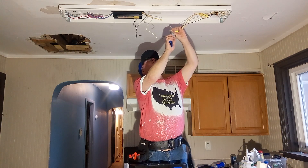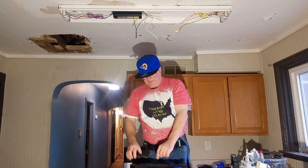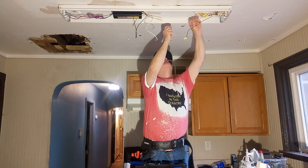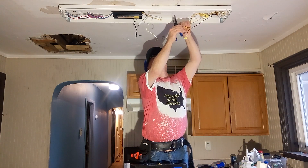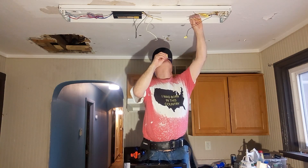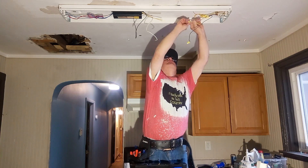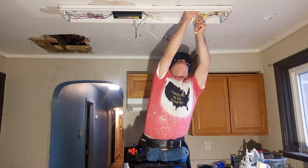We will strip them the same length as our white wire was stripped. This is a pre-tinned wire. Make sure all our wires are even, with the copper at the top. I'm going to clip those two edges stripped a little bit so it is the same length. Get them lined up even, stick our wire nut on here, hold all our wires even so that they do not turn off. Twist the wire nut nice and tight. Make sure all our insulation is going up into the wire nut.